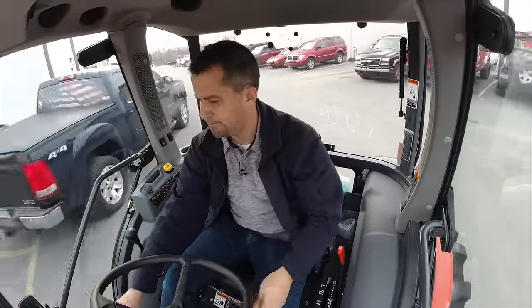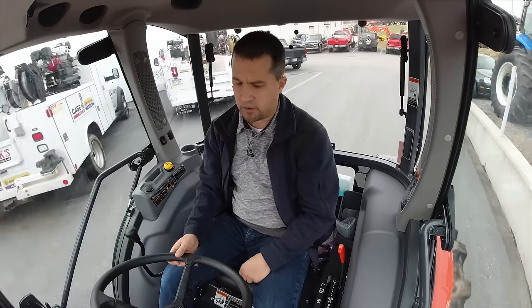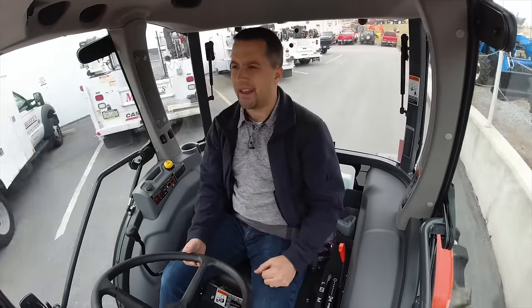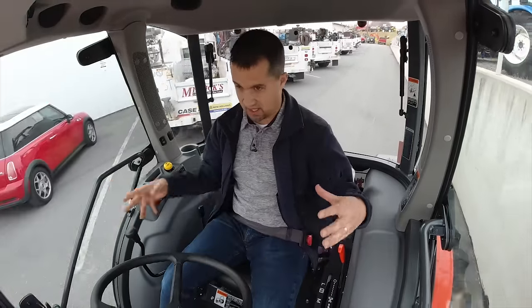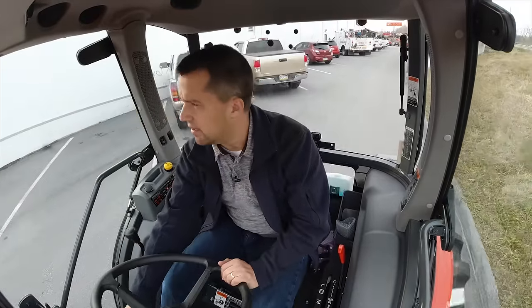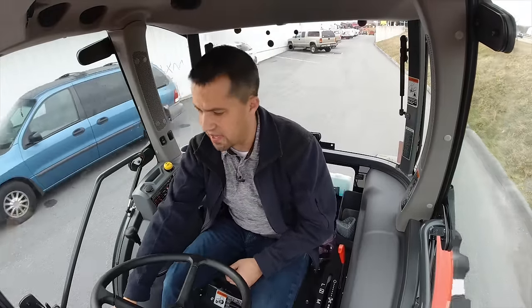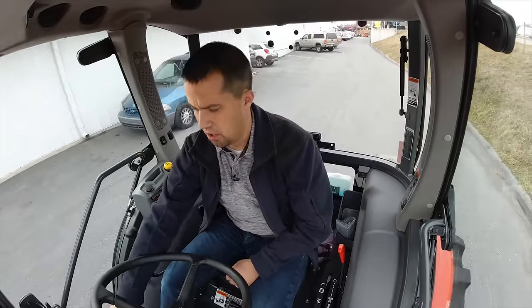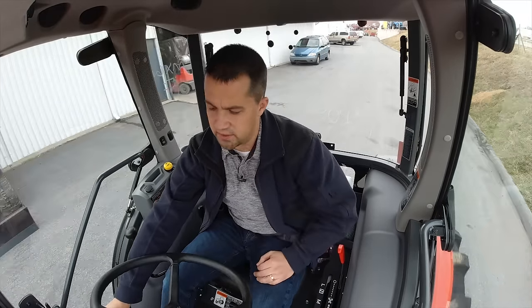I've run the revs up the whole way. Cab noise is a little bit higher than the Grand L series, just audibly to my ear. It's well within the range that you don't need to be wearing hearing protection. If you want to watch that on some of these tractors when you add cabs to them — particularly aftermarket ones — the in-cab noise is actually fairly high. But this is a lot quieter than the open station model. Even with the engine at full scream, it's loud but not too loud. It might come down just 400 RPM to around 2,100–2,200 — that makes a really significant difference in the noise level, and that's where you're going to be if you're doing your loader work.